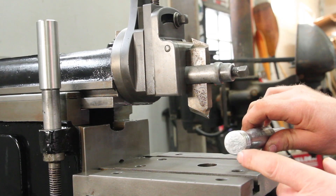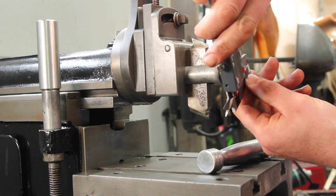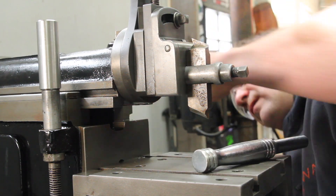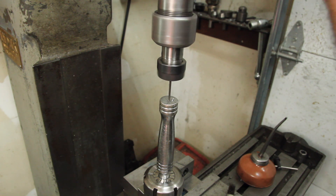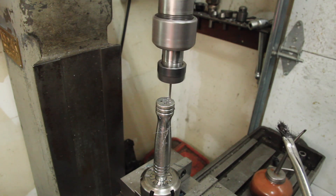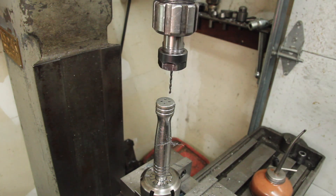I got the handle cut off, and I want to put the 3/8 square in the end here. But before I do that, I think I've learned my lesson. The biggest one measures about 385 thousandths, so we'll go a little bit bigger than that. Same routine once again — start at the corners, work in. This method is a compromise between trying to get the radius on the corners as small as possible versus leaving material where the holes overlap. These are just sizes I've found work fairly well.